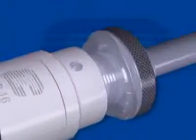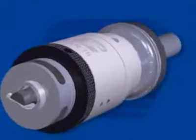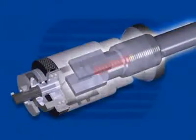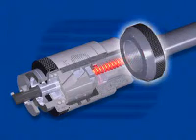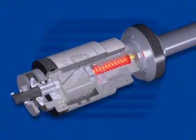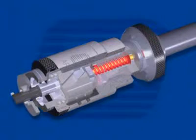The AR series recessing tool can be broken down into several basic components including head, pilot, and cutter. Standard heads are available from stock. The head includes the shank and rear body with the micrometer stop attached. The tool body compresses onto the rear body once the pilot comes into contact with the workpiece. The tool slide and slipper assembly actuate the cutter radially. The spring separates the front and rear body sections during the return stroke in order to retract the cutter.